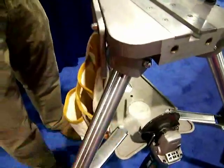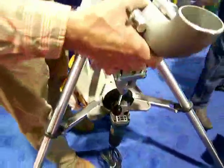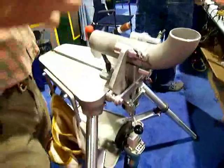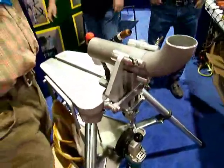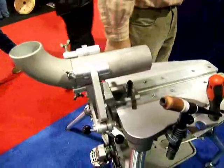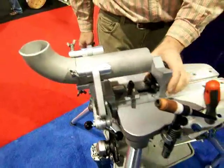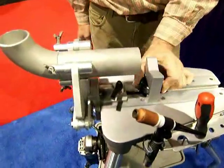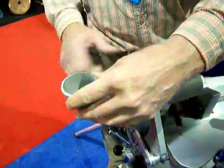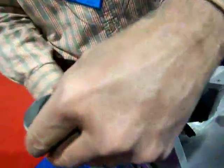It's a very strong, very well-made, very innovative piece of equipment. That half-inch T-slot adapts to fit who knows what — all kinds of vices and clamps. This clamp is especially made for pipe fitting. A rigid pipe vise is okay for screw pipe, but it's not really that great for welding welded tubing and welded pipe. This is specifically for that. It's a fit-up tool designed to weld a 90-degree elbow on the end of a straight stick of pipe or tubing. It's got a sliding V-block to hold the straight stick, and then a fit-up tool that adjusts the mismatch and gets the high-low out of the fit-up.